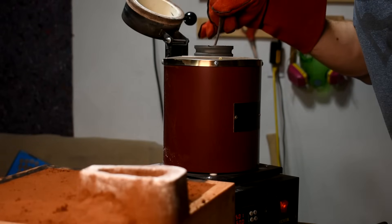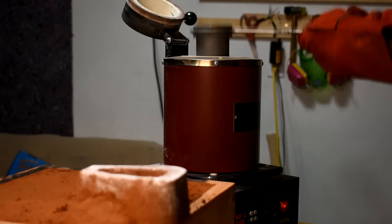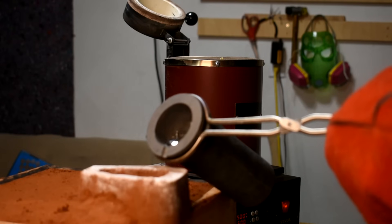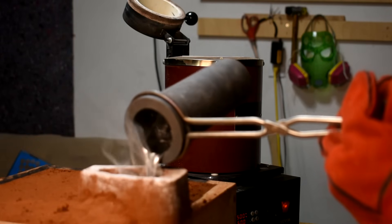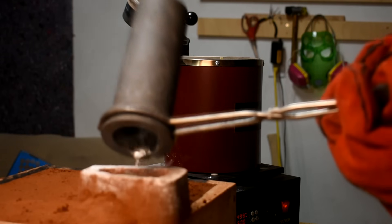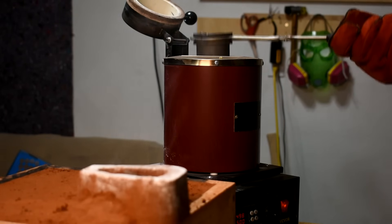With this electric furnace, you can dial in an exact temperature, but I've been expecting for a while that this furnace runs a bit hot. Generally, you want metal hot enough to flow into all the little details of the pattern, and no hotter. The hotter you go, the worse the surface finish, the more shrinkage issues you can have, hot tearing, and lots of other problems. I'm pouring this at 500 Celsius — that's what the machine says — which I would say is the upper limit for ZA-12. If 500 isn't hot enough and it doesn't flow into all the details of your mold, something else is wrong, probably your mold design.